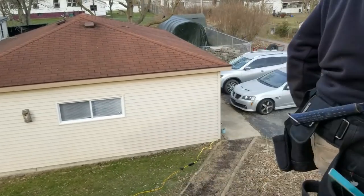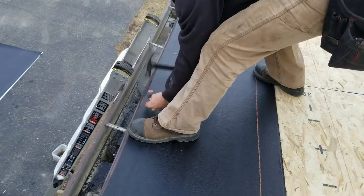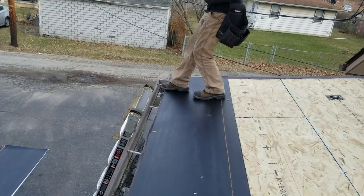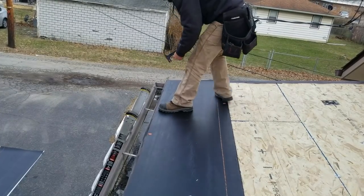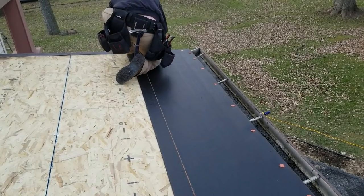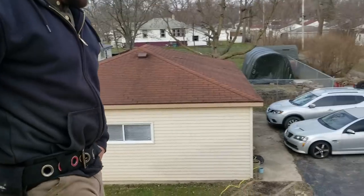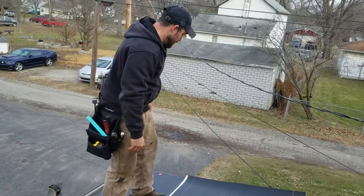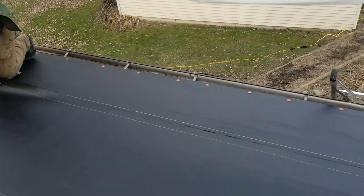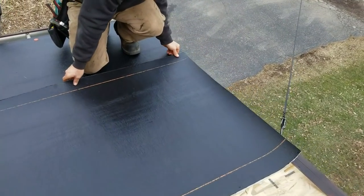Okay. So, we're gonna throw some cap nails in these. You wanna smooth this out real good. They recommend weighted rollers. This is a small section, so I'm not gonna buy a weighted roller for this, is what I'm getting at. Okay. So now that's set. Send that up, man. Yes, sir. Let me square my side up. Go, let's peel this plastic because we can. Okay. Actually, I'm perfect right there.